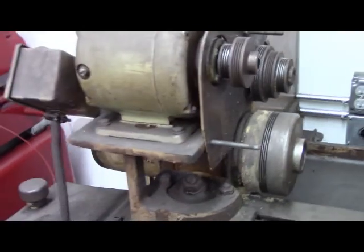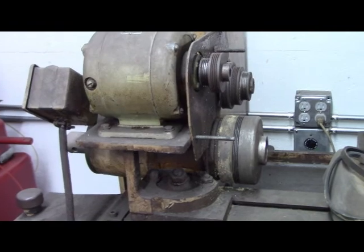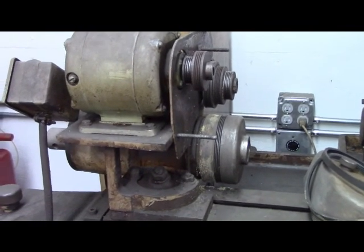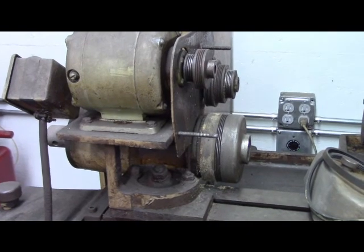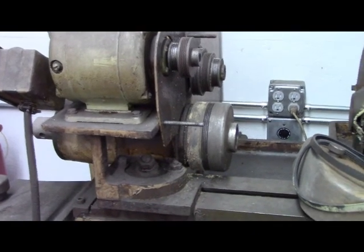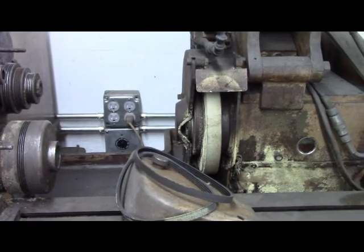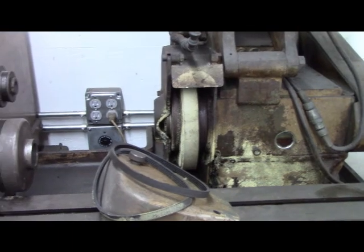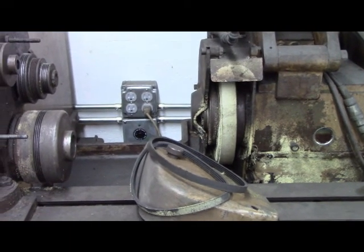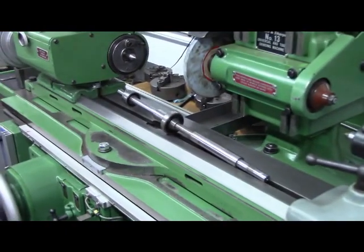But the only 5C accessory for this, other than collets, is a 4-inch Chinese 3-jaw. And 3-jaws are only so accurate, especially on a grinder. They're not accurate enough on a cylindrical grinder. So that's the primary reason for getting that chuck, to use it on here. Now, I know this is the ultimate sidebar.